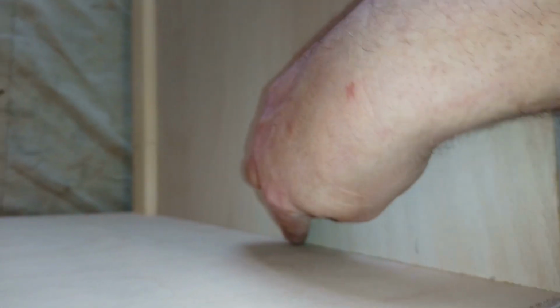See, there's the holes that I drilled from the other side. Now just come over a little bit and get some screws in. You see, when I put this together, I put the clean cut side, see, that's a bit rough, that one, put the clean cut side to the side that you're going to see. Same on all these. So you see, slightly rough on the outside there. Probably me needing a new blade in my saw, but that's good practice to do anyway.